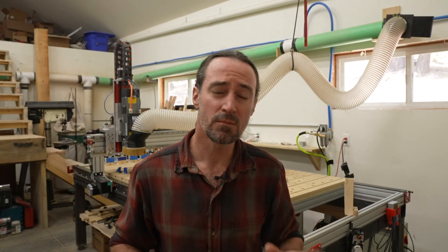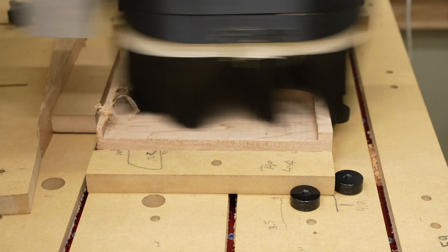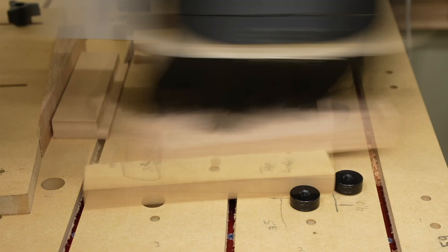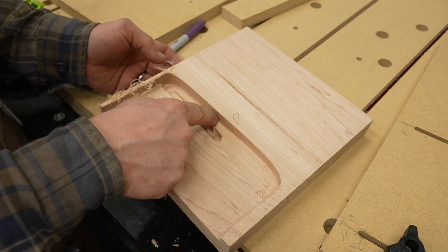One fundamental problem with wedges is that if you squeeze them too tight the piece tends to bow up in the middle, which is not good. That makes it hard to get it really tight for aggressive machining, and during aggressive machining the piece tends to want to lift up. I've had this happen several times trying various ways to hold down with wedges. Now I use some double-sided tape along with the wedges, and that prevents any pull-out problems.